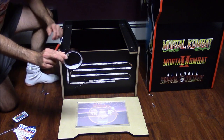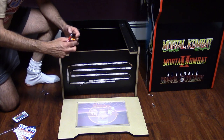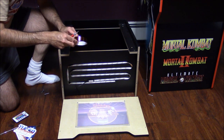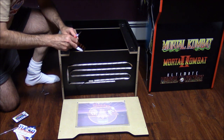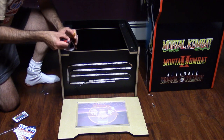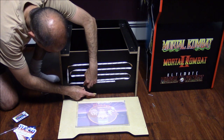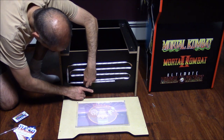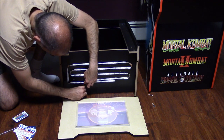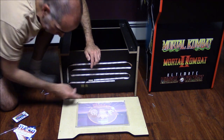Now this is called Kapton tape, and it's really used for electronics. You'll see this sometimes. You open up electronics, there's a piece of tape holding stuff closed. That's what this is here, but it's not necessary for here, but it's very sticky. It sticks very, very well. It doesn't care about heat or any electricity going past or through it. So I'm going to use it here just because, well, I have it handy, and it should work pretty well. So I'm just going to put a piece just like this. Push this thing down a little bit more. And this is really just to give some strain relief on this wire. I'm going to put two of them here, just to make sure nothing gets pulled.